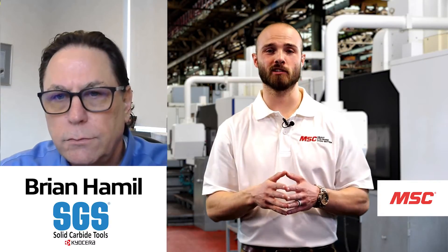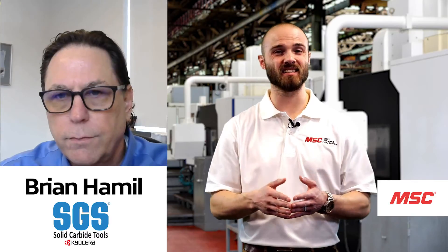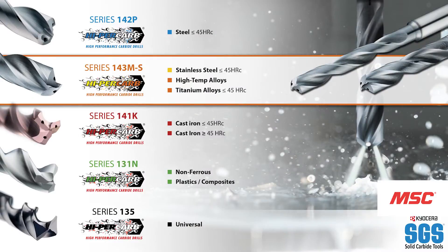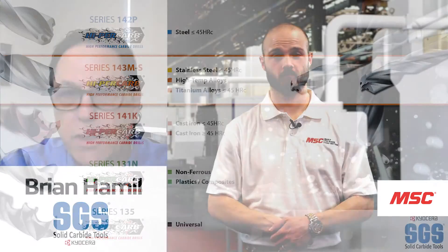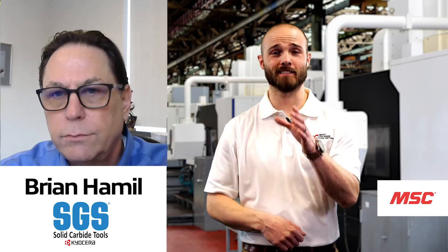Reducing those subsequent operations is a huge benefit to end users. With the HyperCarb series, tool selection is made very easy using the ISO designation within the series nomenclature — 142P for steels, and 143MS for stainless and high-temp alloys. The material's behavior, including its level of elasticity, determines how we shape the chip differently. Simply identify your ISO material code and look at the portfolio of drills to easily select the right geometry for your given material.